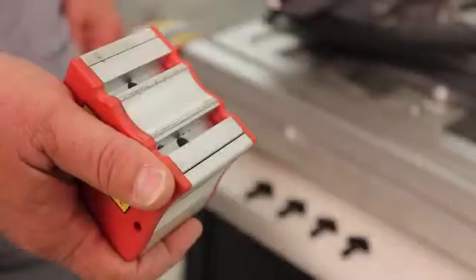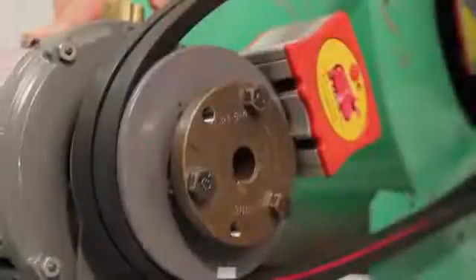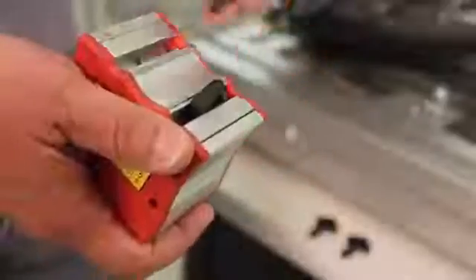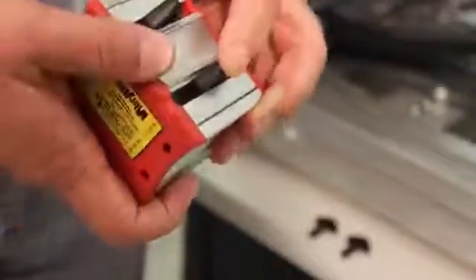The base of both Belt Hog transmitter detectors has a built-in magnet which holds the Belt Hog units to the sheaves of the machines. To center each Belt Hog directly above the center of the sheave groove, V-Belt mounting pins are inserted into each unit's spring-loaded bottom. The use of these pins allows the Belt Hog to align to the sheave groove center where the belts actually run. This is better than aligning the shoulders of the sheaves, which can have different thicknesses.